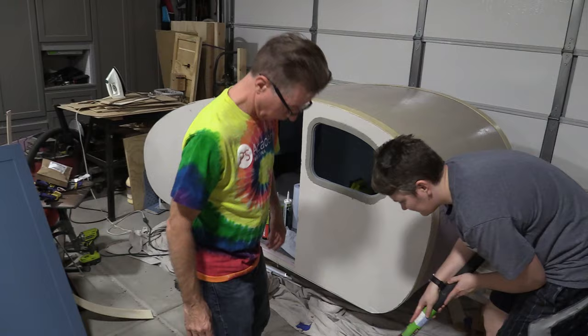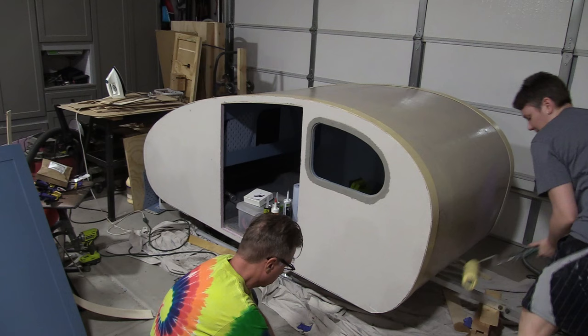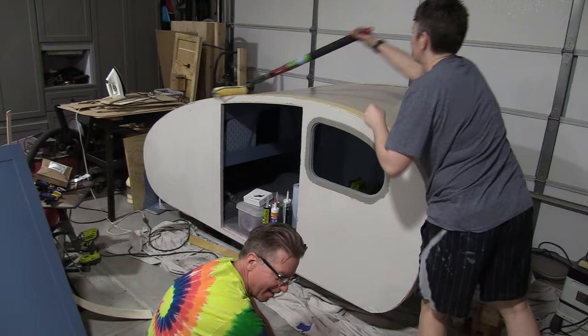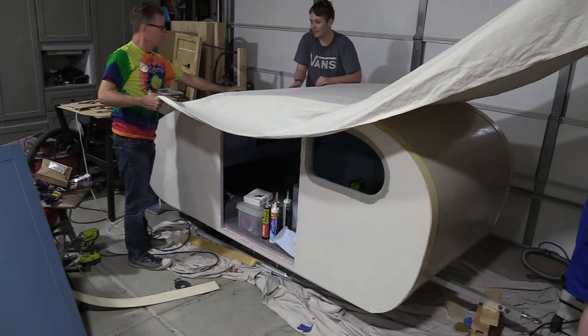You want a chance for the paint that's mixed with water first to really get into that canvas, and that's what's really going to make it stiff and provide a lot of strength. If you have trim like this, you want to make sure that the glue is actually getting onto the inside side of the trim as well — that's going to be really important in making sure that the canvas actually sticks to that part. If you want a nice finish, it's very important that you wash, dry, and pre-press the canvas before you put it on. Any deep wrinkles, you're not going to be able to get out once it's on the trailer.